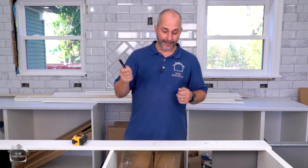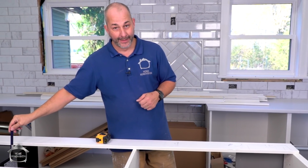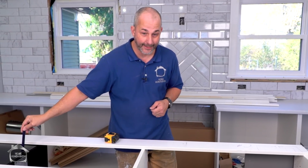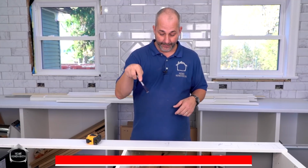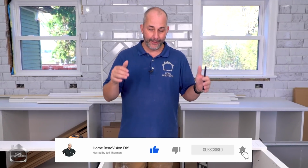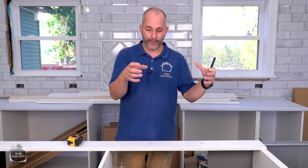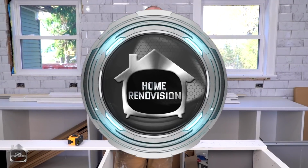Very nice. The second thing you're going to need is, if you're adding the fridge, you're going to need a plug for that as well, right? Refrigerators need to be on dedicated circuits. So now you've got 2 circuits. The sink itself is going to need plumbing. And you've got 2 options. If you want to get the extra storage in your island, then you can get away with connecting your 2 drains, putting this drain back to the back corner and taking it into the basement.